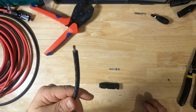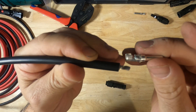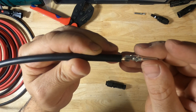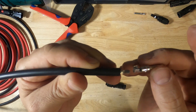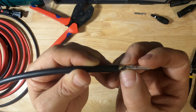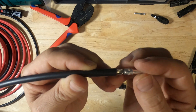First we're going to do the black wire. When you strip the wire back — these are already pre-stripped, so if you buy these you don't have to worry about stripping them. But when you do strip it, you'll want it to be about a quarter of an inch — just enough to get past these little wings here so the wire sits inside the ferrule.